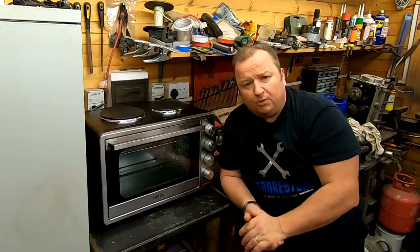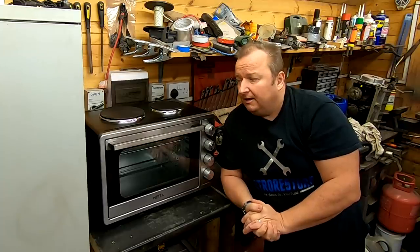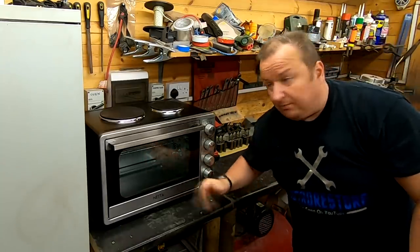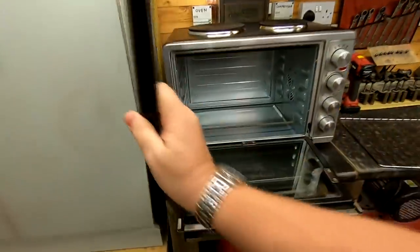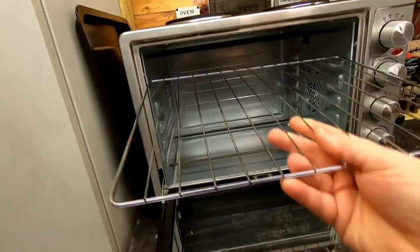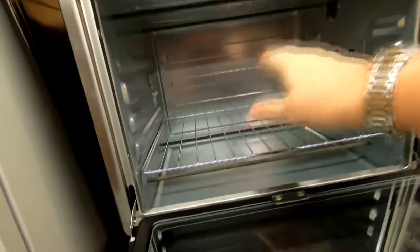The reason is I do a lot of small stuff when I'm restoring parts. To get the big iron fired up, I can have it on for about an hour and it takes about 25 minutes to heat up fully. This thing heats up within about five to ten minutes, if that. Opening the door, as you can see, you've got a tray in there and it came with a drip tray, which I don't really need as it takes up space. So that's coming out. It's quite a big space inside. You've got elements top and bottom, and I'll sit the grill on its highest setting. You can either dangle parts on ropes or put the grill on the lowest setting and stand parts on there.